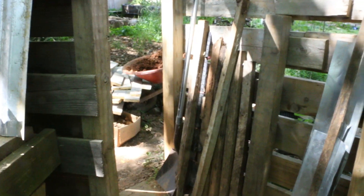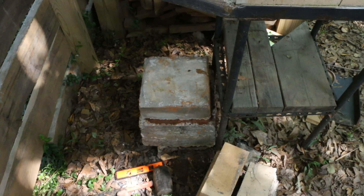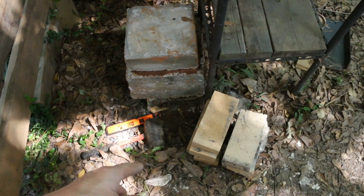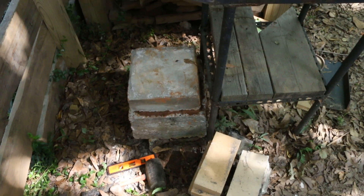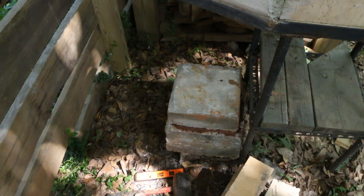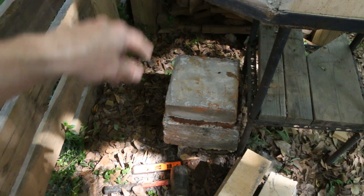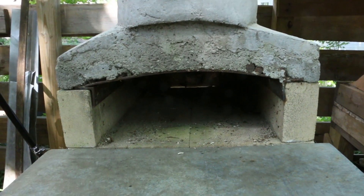While we're right here, let me tell you about what's happening with the pizza oven. I'm updating the rocket stove on it, starting to build the base. I'm actually going to build a fireplace mortar and lava rock riser to go on top of the fire brick firebox. The flue pipe that was in here was just way too long, too tall to get the fire up into the body of the oven, which I want rolling across the top to sort of act as a broiler for that pizza. I'm going to use some concrete blocks to build the space up, put the rocket stove on top, and also finish out the front with some tile.